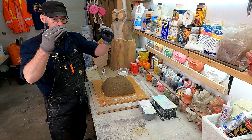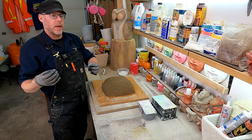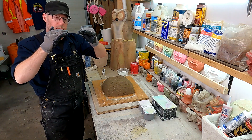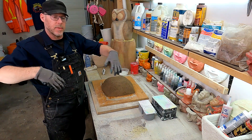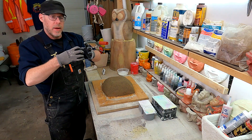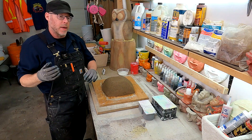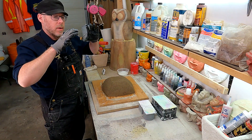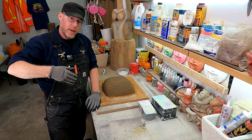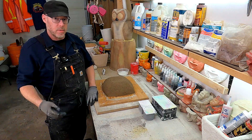In the same way that water can be absorbed and then freeze and cause damage, de-icing salts can cause a similar situation where we make a saline solution. Basically salt water melts the ice, but that salt water absorbs into the concrete, and as the water dissipates you're left with salt crystals. That crystal growth is a destructive force, and there really isn't enough space for it with de-icing salts. With freeze and thaw we can use Air Entrainer, but with de-icing salts you really can't do enough to protect the concrete — that's why they say don't use de-icing salts with concrete.